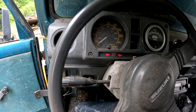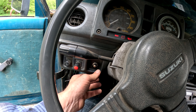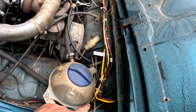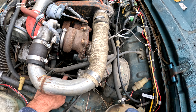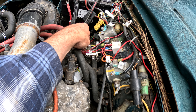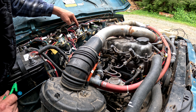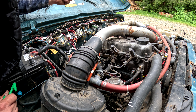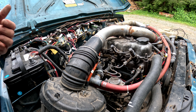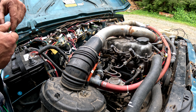I can hear a solenoid clicking up there. I don't even know what these buttons do. This one says 'starter' and it's got a yellow wire that goes all the way down to the starter. This one here says 'glow plug switch' and that goes to the glow plugs. When I turn the key, I'm not getting any power through this solenoid right here to the starter — the starter itself isn't getting anything, but the solenoid is clicking and there is power on this side of it. This must've failed somehow. These are really cheap — probably like 15 bucks. In the meantime, I'm going to try jumping across it. All it's doing is passing current to the solenoid side of the starter down there, so I should be able to jump around it.